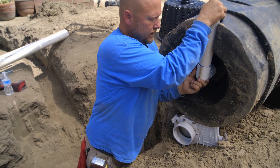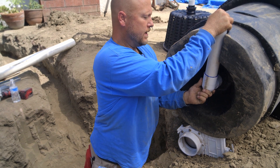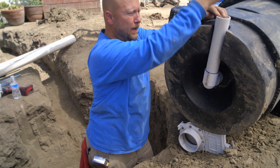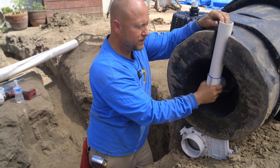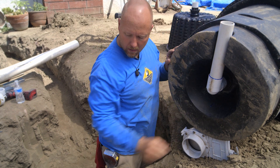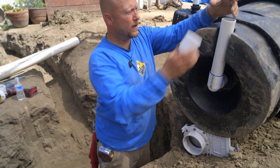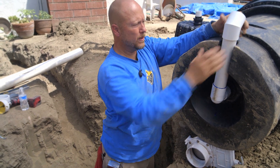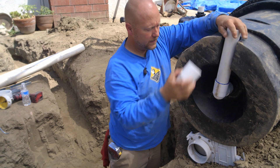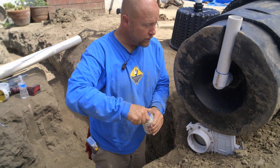I got that pushed in and I'll hold it — let it harden off just a second. I could sweep my pipe right into here but it proves to be a little bit of a challenge. So what I often like to do on this particular unit, I'll either put a coupling on here and run my pipe right into that, or I might even sweep a 45 on this particular one as my trench drops into here. But this thing's ready to set now on the ground — I want to plumb the bottom drain in first.